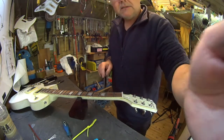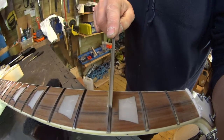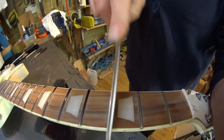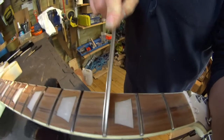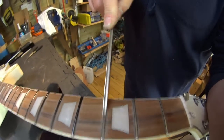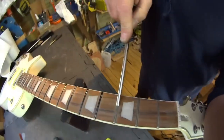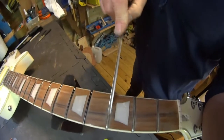But these have got such flat spots on them that you can see the centre line, the black line. You can see how much I have to work at it to reduce that line. What's really happening is that I'm rounding off the shoulders, the edges of the flat spot, and the more I round them off, the thinner the flat line gets as the fret becomes more like an arch. Sorry, it's moving, it's not very good visuals, but I've only got my elbow to hold it still.